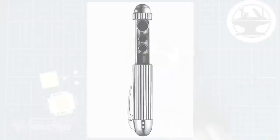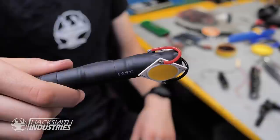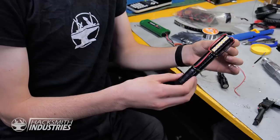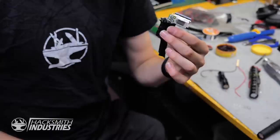To make it flash we have two options: we can either use a flash from a disposable camera — something a lot of our younger audience has probably never seen before — or we can use some high-powered LEDs. I believe the original Neuralizer probably used a camera flash, but modern LED technology has become quite impressive. Ben has whipped up several prototypes to compare the two technologies. The first prototype used a single 60-watt LED with 45 volts of capacitors. The second used 42 volts but with six 9-watt LEDs. The third used a recycled camera flash, which can recharge constantly and fire indefinitely.